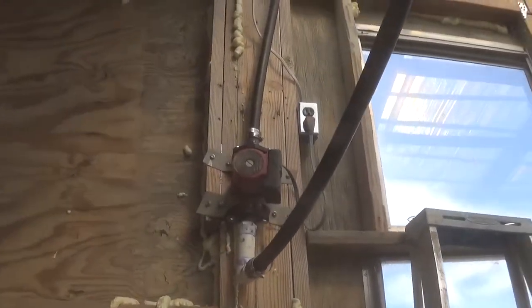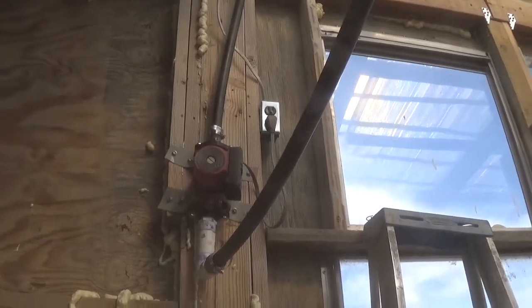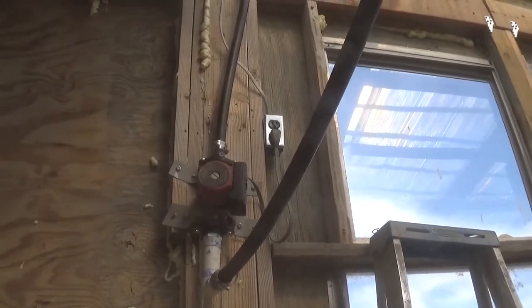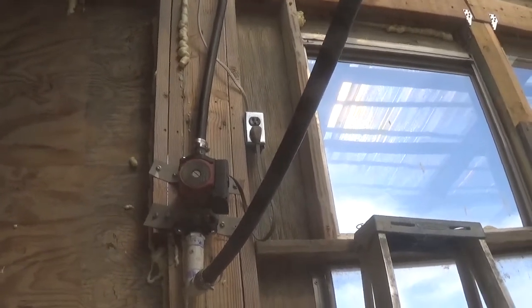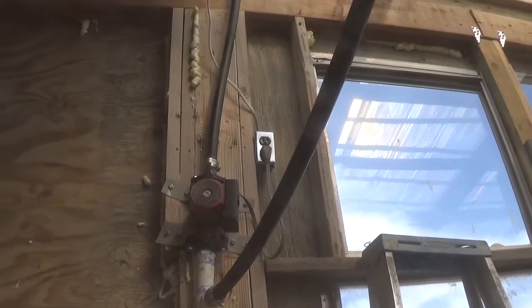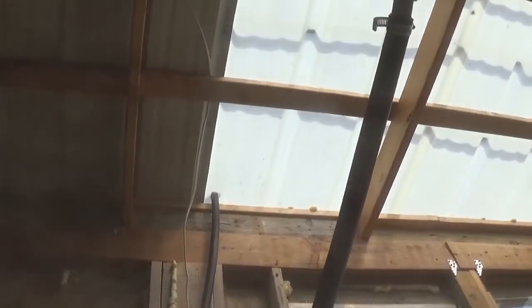Right there is my inline pump — it's a Badger pump, but you could use any pump you want. This pump is designed to pump pressurized hot water through your house so that you always have hot water available at a tap without running and wasting water. And then it pumps it up to the roof like I showed you.